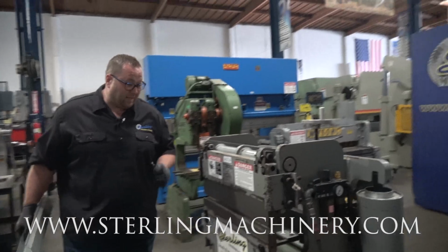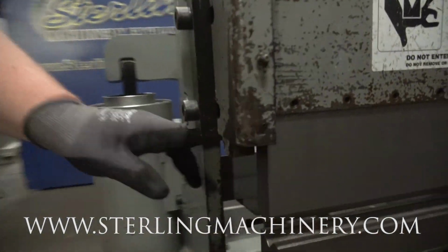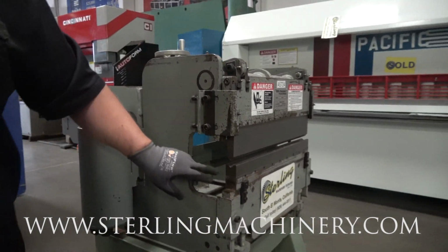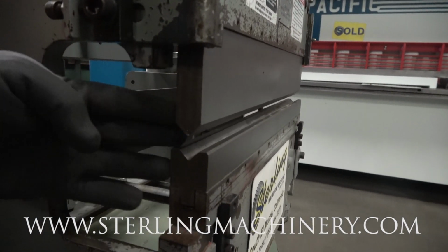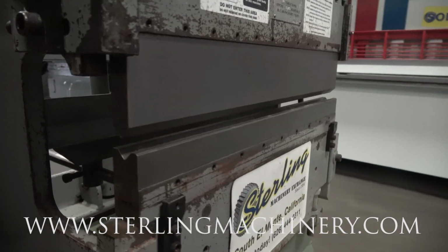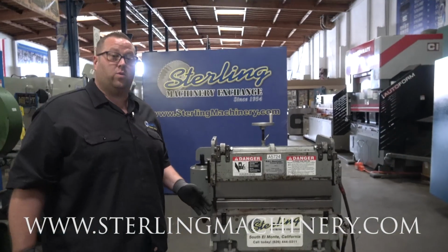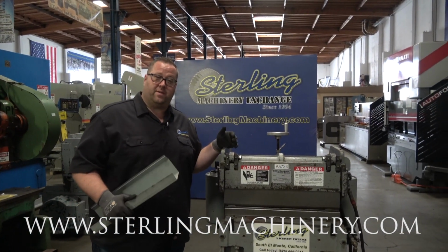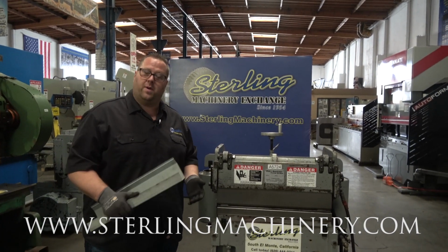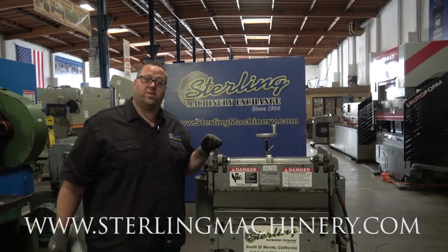Now, one really cool thing I like to notice, if you look over here, it's got a nice deep throat, so it's going to allow you to do a lot of different things. But you're also using standard American dies. So all this tooling here is the standard press brake tooling rather than having a box and pan finger brake. This one's going to allow you to put different tooling into it. And it really opens up the world of possibilities with different types of punches, unipunch, press brake tooling, whatever you can get in there to go ahead and make the parts you need.